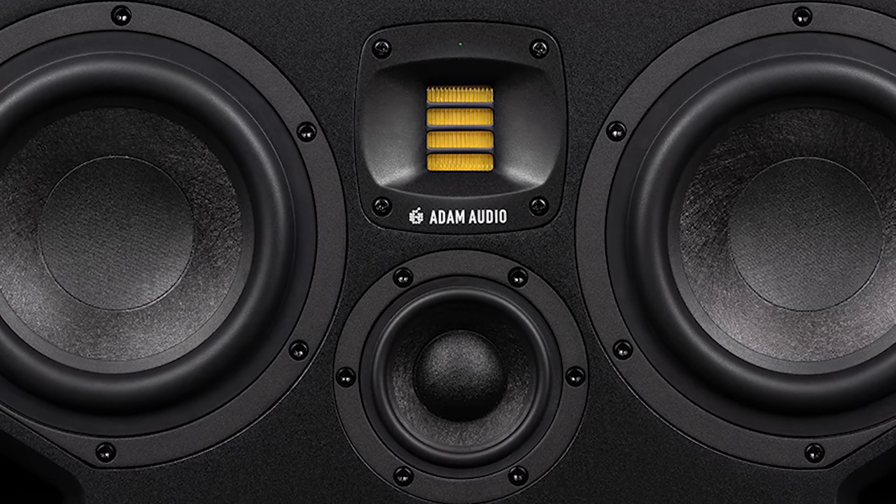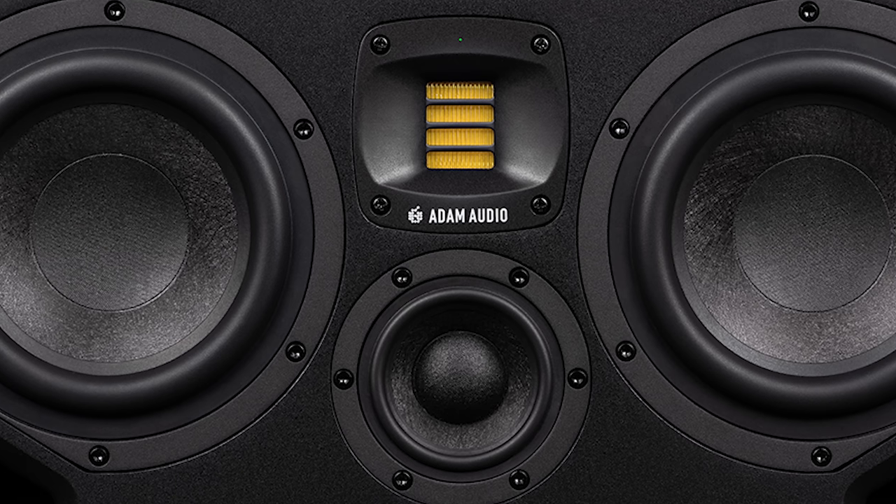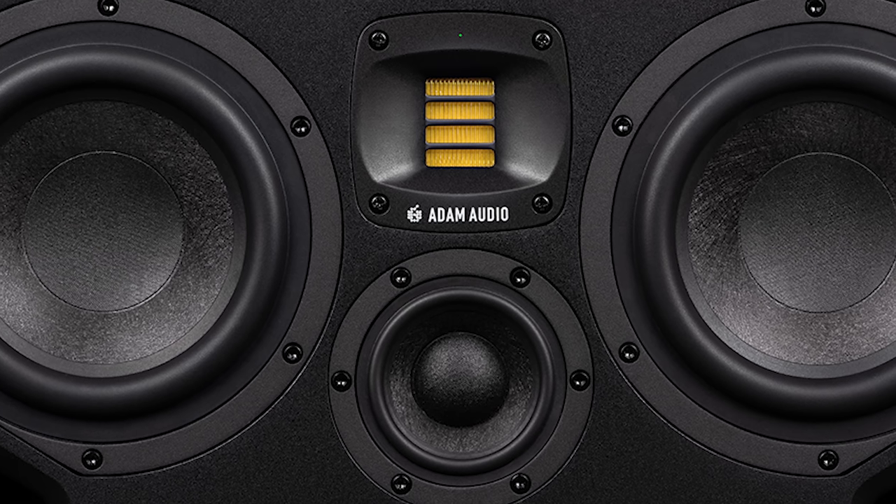In the A77H and the A8H, the A Series mid-driver was adapted from Adam's groundbreaking dome-cone hybrid, or DCH, mid-range drivers used in the S Series. The A Series mid-range driver is designed for transparent performance in the critical mid-range frequencies — the range where the human ear is very sensitive to coloration. It uses the same multi-layer mineral fibers as the woofers, specifically layered and cut for mid-range, with an underhung magnet system positioned inside the voice coil for a linear magnetic field, providing maximum output with no audible distortion.